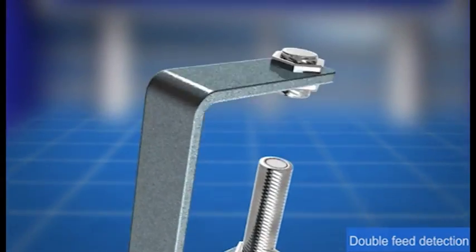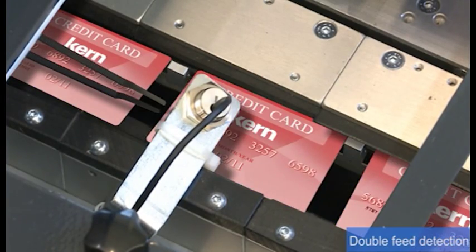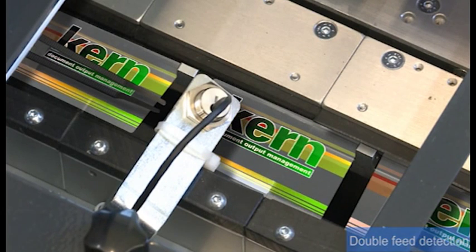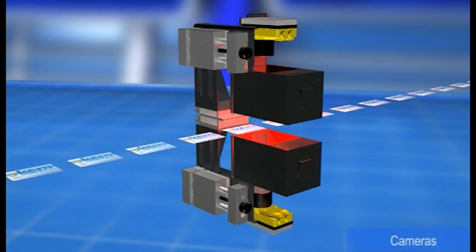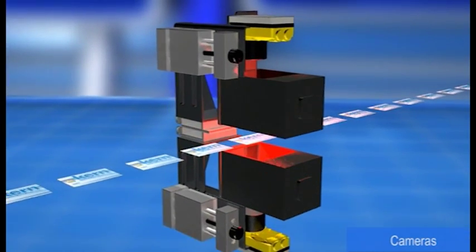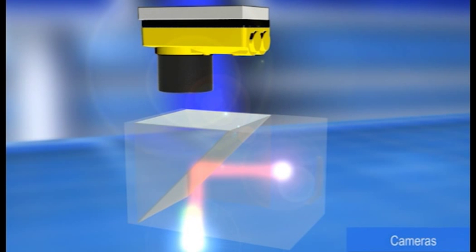With this type of processor, we can process the following cards: standard, emboss card, transparent cards. The first card reading is done by 2 telecameras, one for the front and one for the back of the card. Each telecamera has a special lighter called coaxial. The light rays are parallel to the lens of the telecamera. This allows to remove any type of reflection.